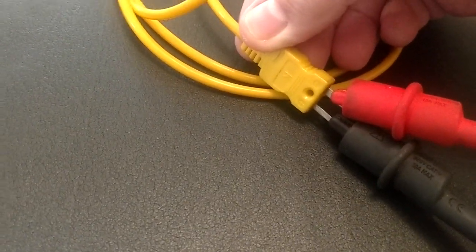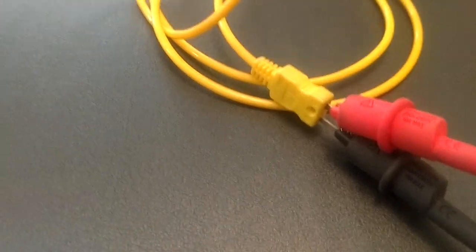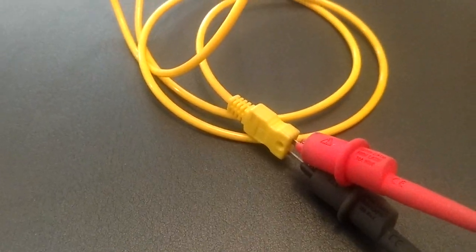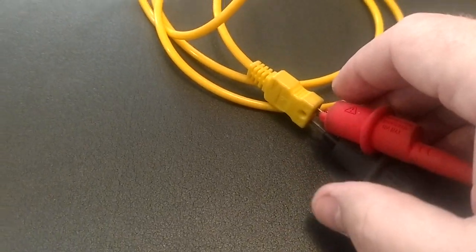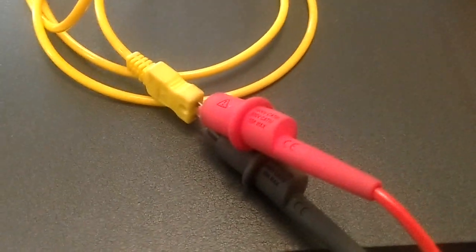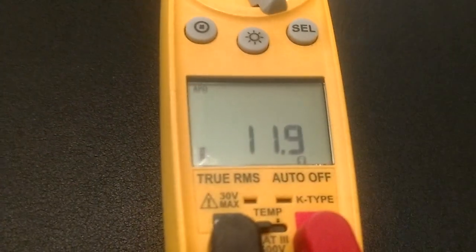and we're going to take an ohm reading through here. Now, here's another thing to keep in mind, guys. These are thermocouples. These are not thermistors. I repeat, these are not thermistors. Thermistors are those little teeny tiny things with those Molex plugs that are on all these new units, on our mini splits, on our inverters, on our new demand defrost. All these systems are full of little thermistors, and those thermistors are going to change temperature, and as they change temperature, they're going to change ohms.